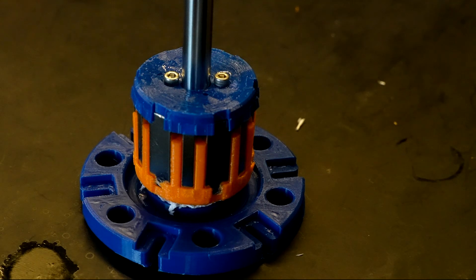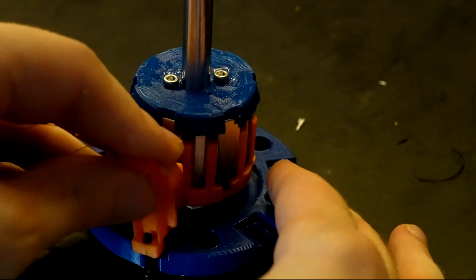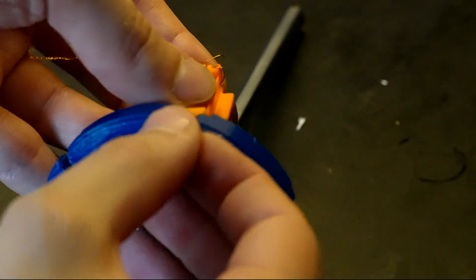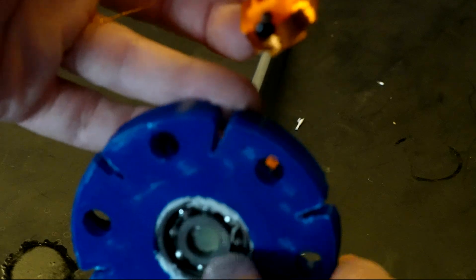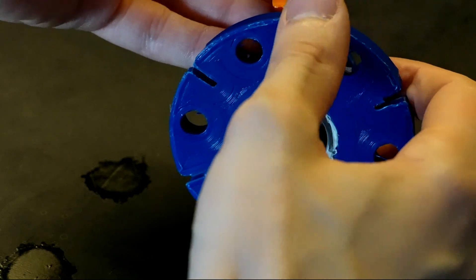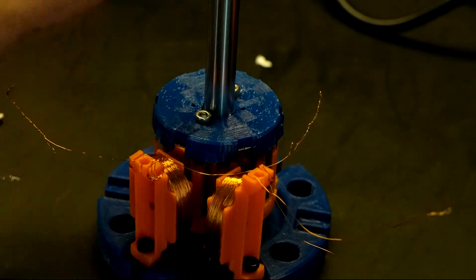For the bottom cap I was able to use a napkin and tear away the excess, and that worked pretty well. After the bottom half of the generator was essentially assembled, I began fastening the coils to the bottom cap. I made a change to the caps here: instead of having slots where the coils loosely fit and then two screws fasten the two halves together, you now have slots where you insert screws to fasten the coils directly onto the stator caps. This prevents wobble from the coils and makes the generator a little bit sturdier.